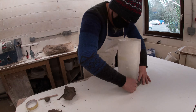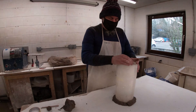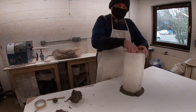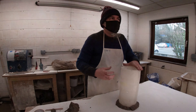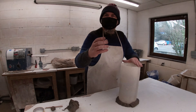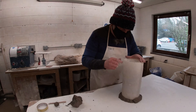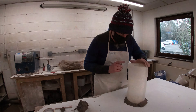Once you're happy and you've got your mould ready, this is now ready for pouring. We've got to think about how much plaster we're going to need. Just like the two fingers of width around the edge, we also need two fingers' thickness along the bottom up from the base. I think I'm going to need about two pints of plaster to make this mould, so we're going to make two pints and move over to the plaster bench.